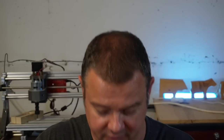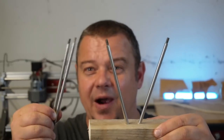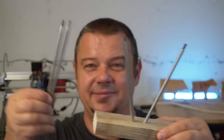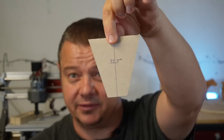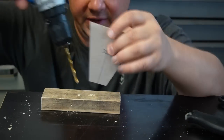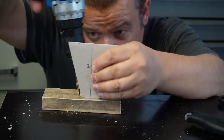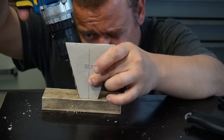As I already told you, these diamond rods have grit steps from 80 grit to 3000 grit. So you can choose the grit you need for your desired result. If you don't have a drilling machine where you can swivel the table, you can do it also with a normal hand drill. For that, you need a template with the angle you need and the 6 mm drill. So all I can say is, take your template and align the drill as accurately as possible.